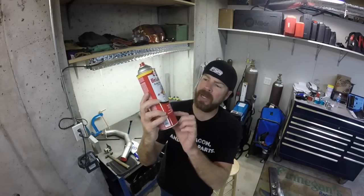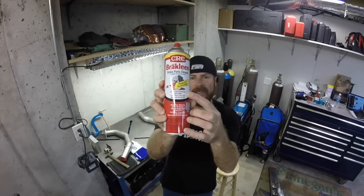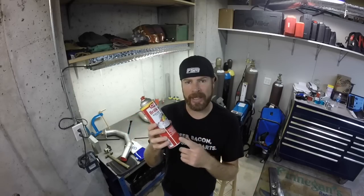I want to talk a minute about something that upset a few of you last time I posted a video about welding. In part one of this series, I showed you that I was cleaning the stainless steel tubing with brake clean. And that spooked some of you because I think you assumed immediately that I was using chlorinated brake clean when I wasn't. I was actually using non-chlorinated brake clean, which, if you look real close right here, you can get in the red can. I know, weird, right? You're used to seeing non-chlorinated brake clean probably in a green can. But according to CRC, and this is the truth, there's many different formulas of this depending on where you live. And if you live in California, you can get non-chlorinated both in the green and the red can. So don't worry. There wasn't going to be any phosgene poisoning. I wasn't killing myself. I was actually using non-chlorinated brake clean.